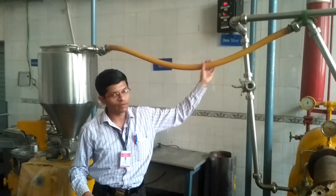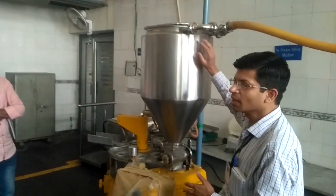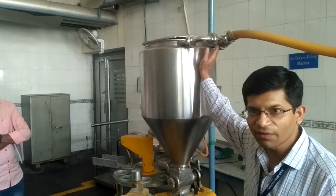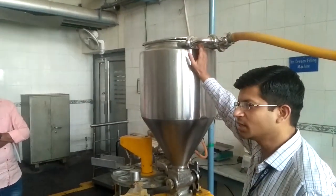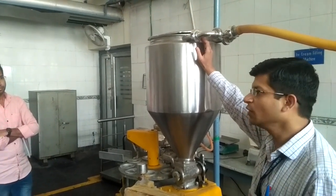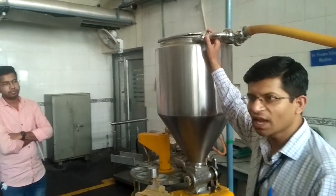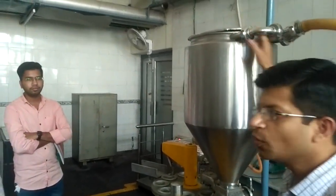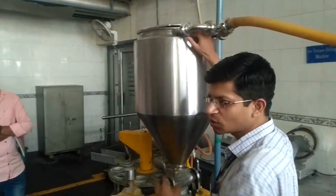From there, this flexible pipeline continuously feeds the ice cream coming into this hopper of the machine. Here you can see that this hopper is dividing this stream into two parts, so that it eases the flowing of ice cream. Because ice cream is in semi-solid form, if it is allowed to flow in one bowl, it may choke. So if we are providing lesser diameter pipelines, it will have more flow speed, so it will come out faster than a larger diameter.